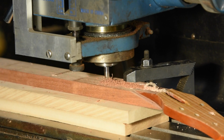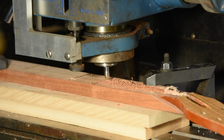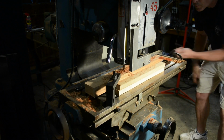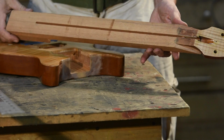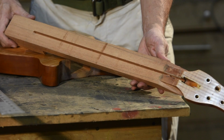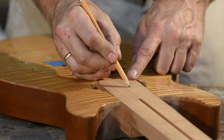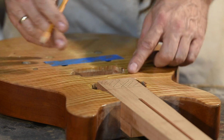Next, I'll mill out the channel for the truss rod. You can do this with precision undreamed of by woodworkers and their laughable little routers. But seriously, mills are capable of precision overkill when it comes to woodworking. As long as it fits, you're fine. In fact, metalworkers have to be careful about being overly precise, cutting things without sufficient relief to allow the wood to expand and contract.